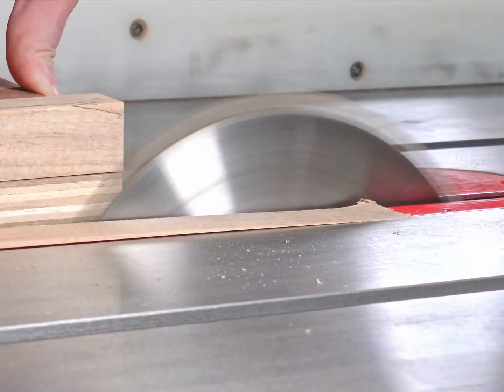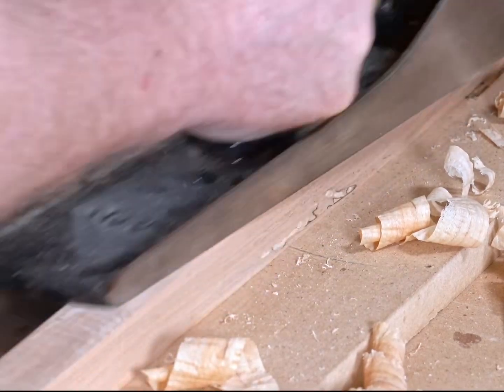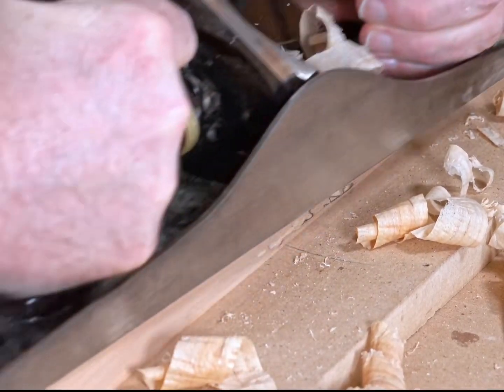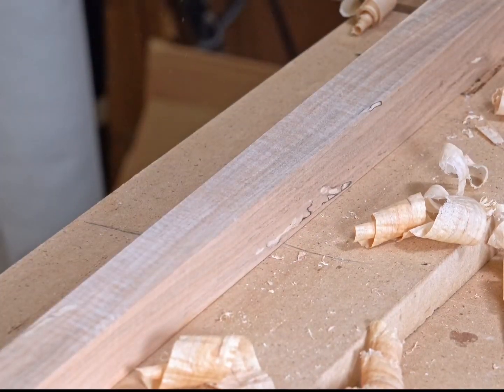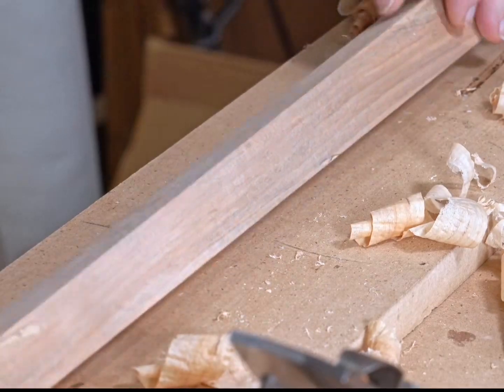This jig is working really well so far, not bad for some scrap plywood I got from work out of an old shipping skid. I'm hand planing the legs to get them smooth and flat in preparation for mortising. Taking the time to do this now should mean less drama when it comes to getting a gap-free joint between the rails and legs. The grain on the legs is all straight enough to be hand planed without any tear out like I got on the rails.